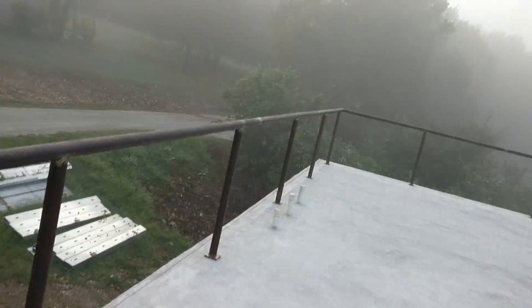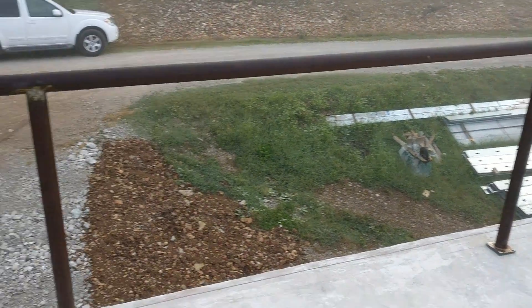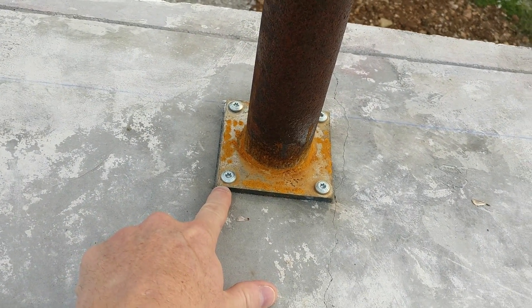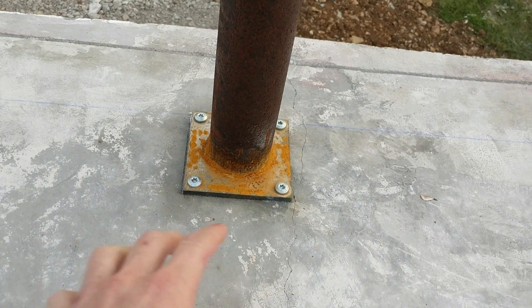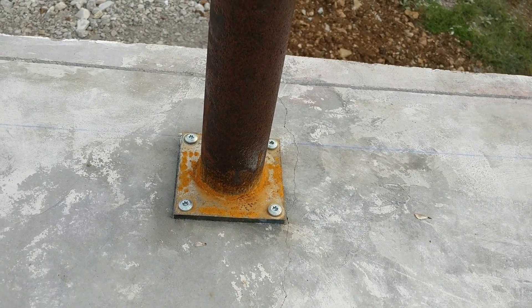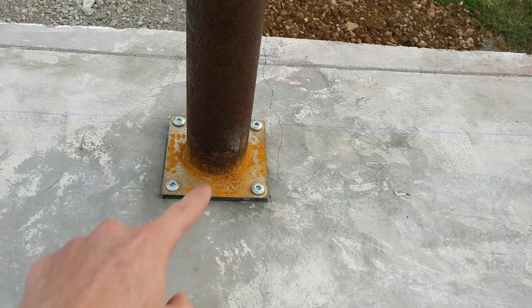So I have my columns — this pipe was cut out of the 10-footer and made multiples; I got three of them out of one 10-foot stick. Then I had the base plates made. I believe they are 3/16ths — I went to the steel company and had them laser cut. They took a big sheet and did a 4x4 with holes in the corners, just made that same pattern on a full sheet and cut them all out. The nice thing is every one of those holes is exactly the same in each plate because it's laser cut.